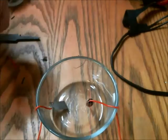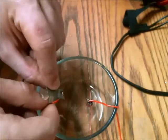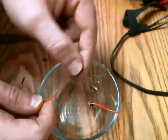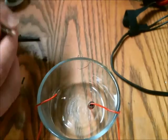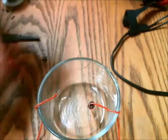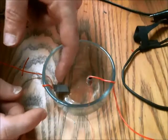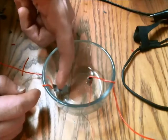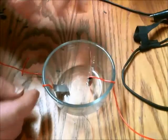Here is the nickel anode — this is the positive side of the 5 volts. I drilled two small holes in it and ran a wire through there. I ran the wire through again so it won't crack off when I move it. So this is the nickel on the 5-volt positive side, and here's the tip, which would be the negative side of the 5 volts.